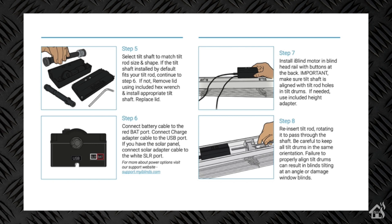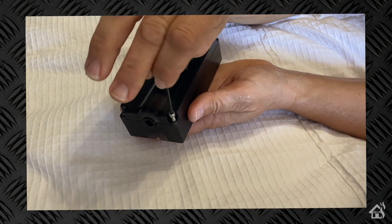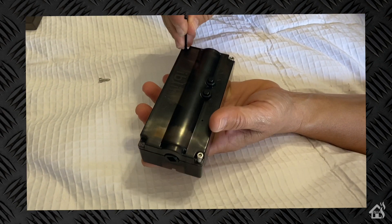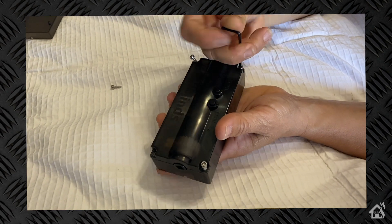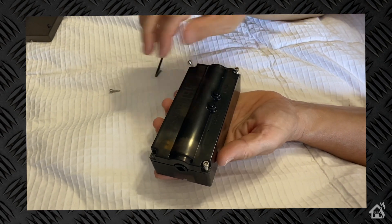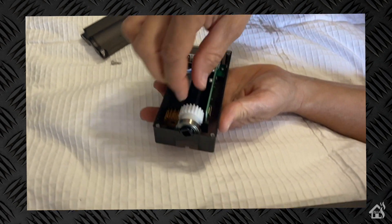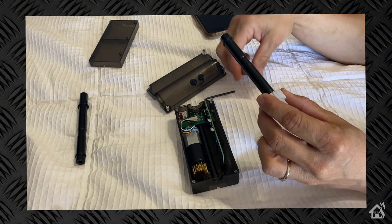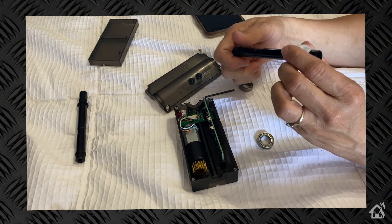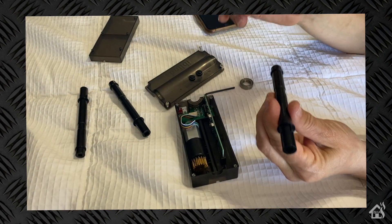As far as the next few steps go, you need to pick the right shaft that fits your type of blinds and then get it inside the blinds, run the rod all the way through, and tuck everything away. Here I've got my lovely wife helping me today — she made sure this was as far as it got on camera. We're going to unscrew this cover, pop out the rod, and put in the correct one. Check beforehand because you may already have the right one. Just make sure you remember the configuration so you can put everything back correctly.